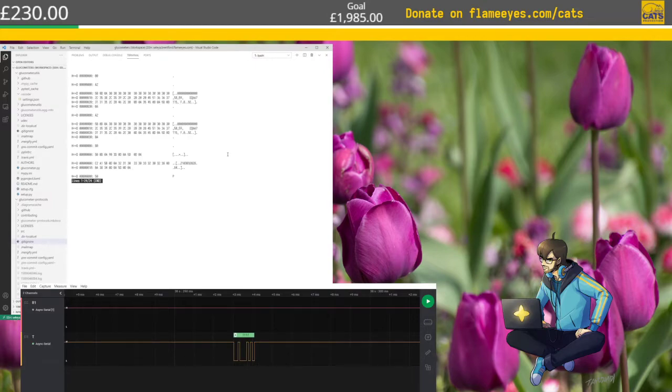You can definitely hear the hissing. Let me look at the analyzers — serial. This means the tip is the host-to-device. It's not 115,200 baud. I think it may be 4,800 — no, it isn't. There's an auto-baud-rate option. Is it 9,600? It's not 9,600 either. Let me check common serial baud speeds: 4,800 or 19,200.